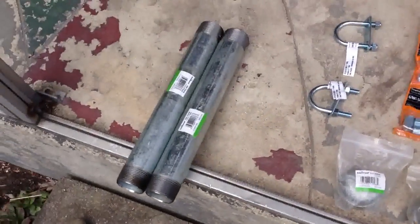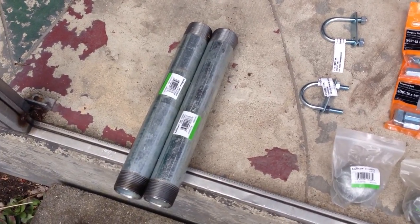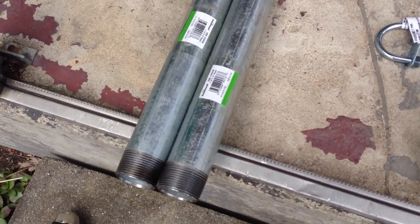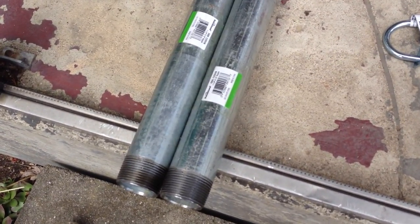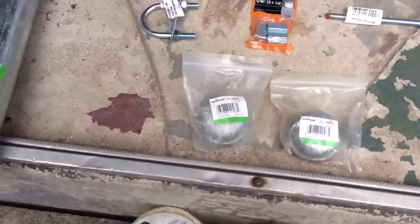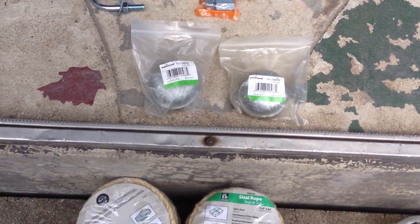For inside the ground, we're going to anchor these down a little bit to put our top fence post pipes in. These are galvanized short sections — one and a quarter inch by 12 inches long, threaded on the ends. We're going to use the end caps on the ends so when we hit it with the sledgehammer it won't damage the threads.